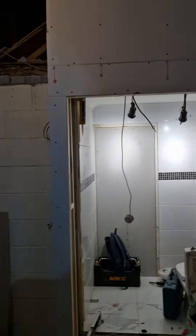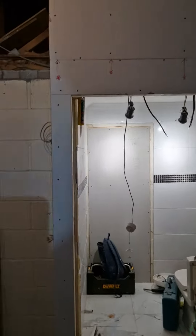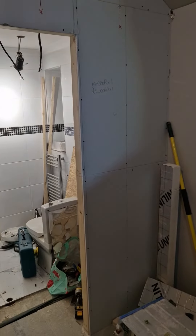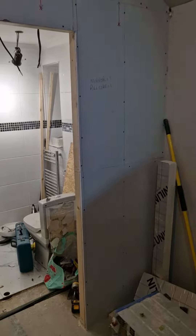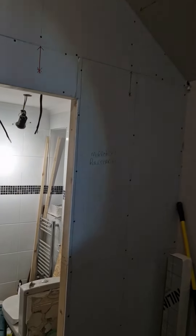You won't believe - just in this garage here, I've used 125 meters of twin and earth 2.5mm and they don't go any further than that point. I've used about 75 meters of 1mm and I've used 50 meters of 6mm because I've got a big length running all the way there. I've also got another length running all the way to the back of the house, ready for power to the shed.